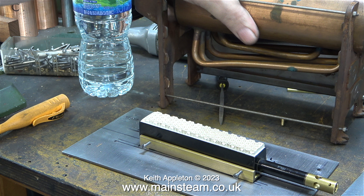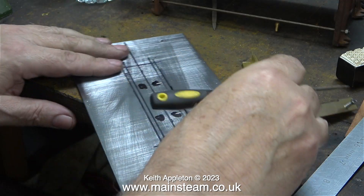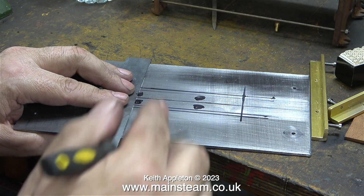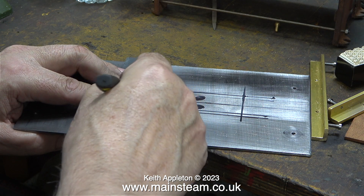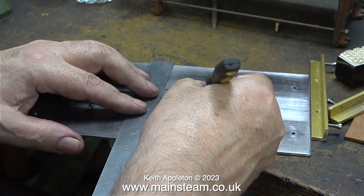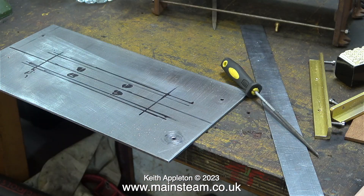I'd just like to mention that this is not the boiler I'm going to use. And now it's time for a felt tip pen frenzy. Apart from the lines, there are some large dots on the base plate, and I'm going to use these to make it easier to see the scribe lines that I'm currently marking with a needle file. The positions of these scribe lines were in the correct position, so I drilled some holes through the plate and countersunk the holes from the other side.